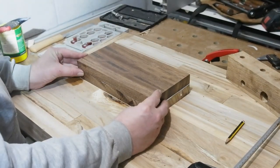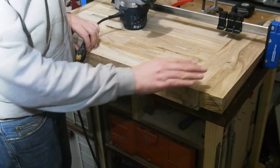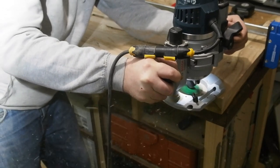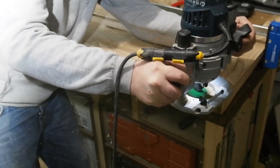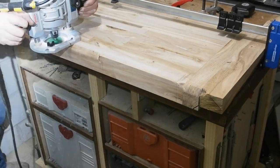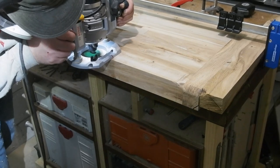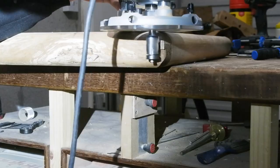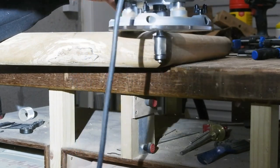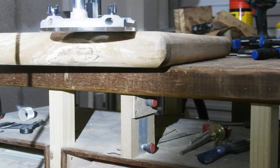I'll come back to these when they're dry. In the meantime I crack on with shaping the top. I've got a large round-over bit in the router — 25mm radius if I remember right. I clamp a bit of scrap to whichever end I'm working on to catch the route a bit and stop any breakout. You can see on the front I've left a section unrounded where the vice is going. Then I made things difficult for myself by not remembering I wanted round corners — that should have been done first. Never mind, it'll all come out in the wash.